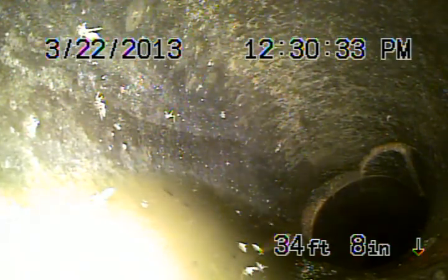You're going to see more roots here. This is the 4-inch clay pipe heading through the backyard. It takes a slight little turn. You can clearly see that piece of clay right there to the right portion of your screen is cracked and broken.